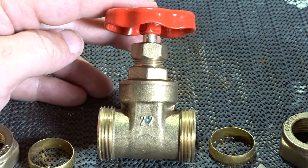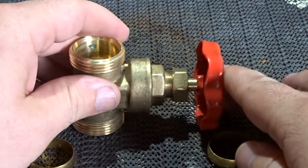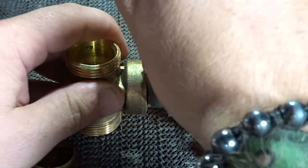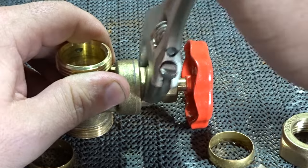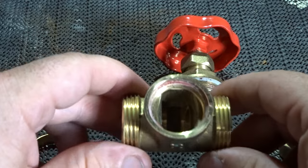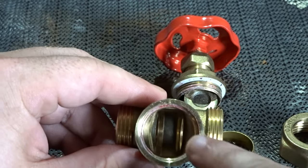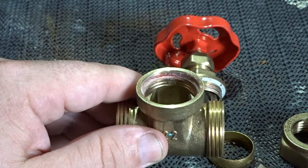To take it a bit deeper, all you need is an adjustable spanner. Just loosen off the top join — that'll remove the gate from the valve housing. Turn it in an anti-clockwise direction: lefty-loosey, righty-tighty. The housing is now stripped down and empty. You might be able to see the groove in the bottom where the gate sits down to stop the water passing, and we have our threaded section around the top.